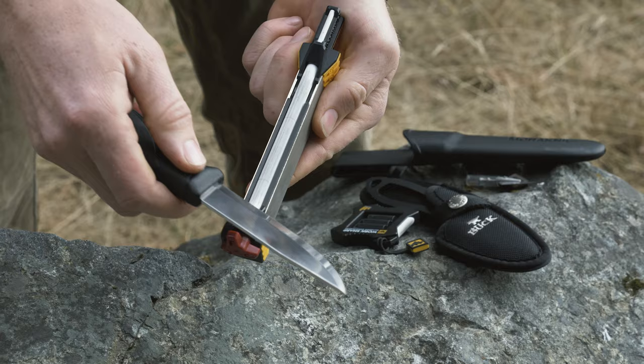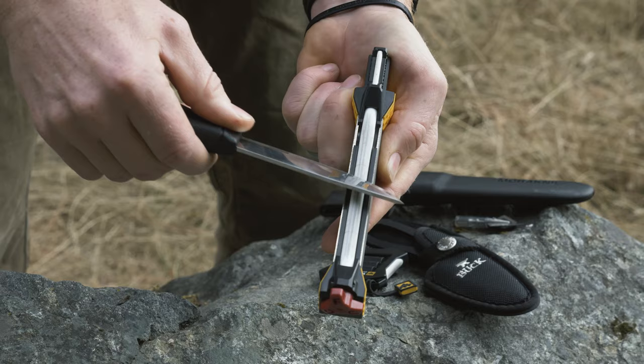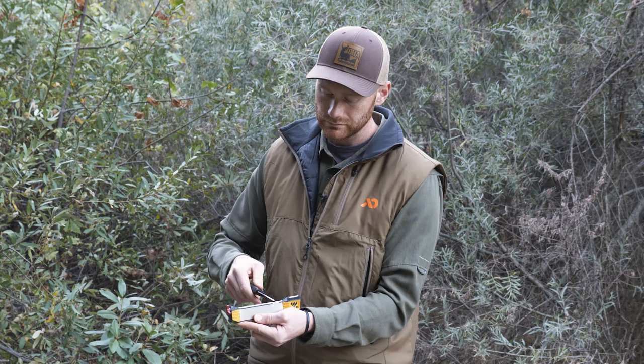The process is the same — rest the knife on the guide, bring it to the abrasive, and make a pass across the stone. When I work on the ceramic I'll alternate strokes, one stroke per side. This pushes the burr back and forth, refining it further until it disappears completely.